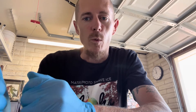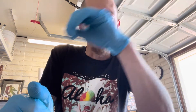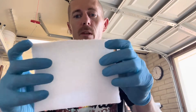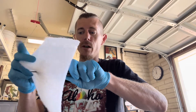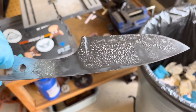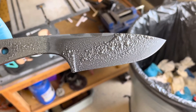Sulfuric acid doesn't really work well on high carbon, but there is stuff out there you can find that will work. We're going to do two or three dunks at about 10 to 15 minutes each. We're almost done with the first one, so let's go ahead and pull it out and see what that looks like. I'm going to use this white Scotch-Brite pad, cut it in half — it's a little big — and we'll scrape some of it off, then put it right back in the solution.